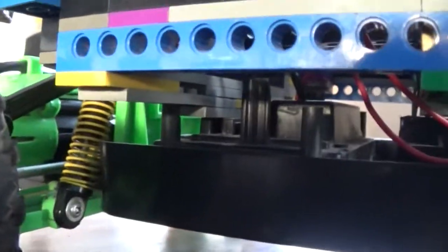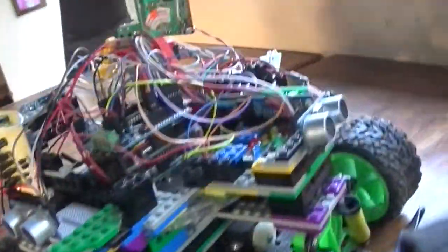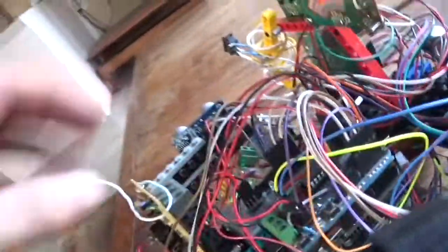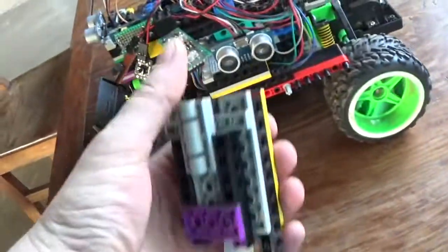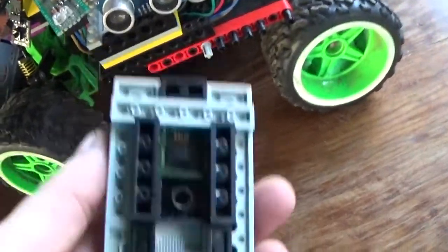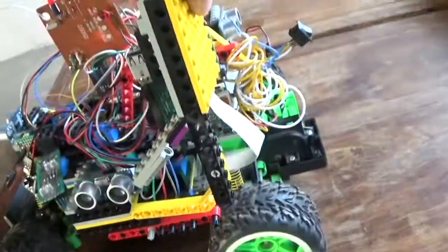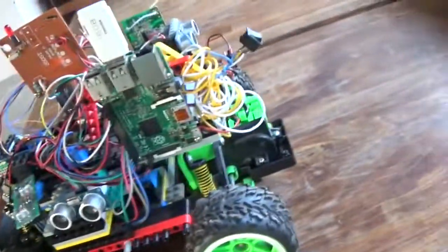On this, there are two screws that I'm able to connect to. The front part is just loose — it's just resting. So everything about this is on those two screws. I was able to use Lego to connect so that the Arduino is screwed into this plastic board, in between the Legos. It has to be a Pi camera, which I'm going to plug in right here, and then I'll be able to record video as the car moves.